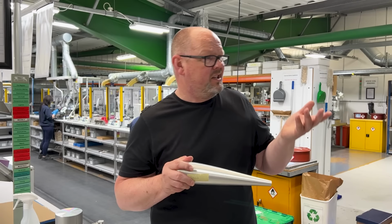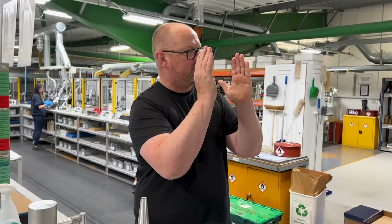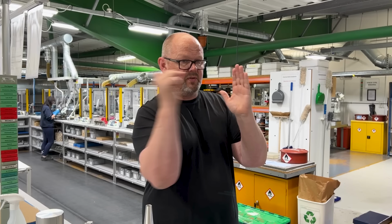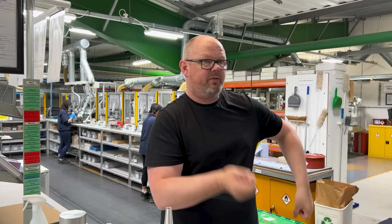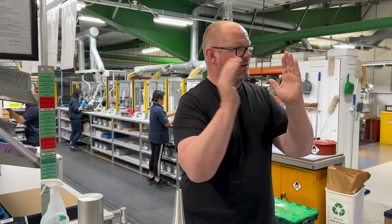So the idea is, if the diaphragm's doing that, it's generating pressure inside the enclosure. The more it moves, the more pressure builds up inside the enclosure, to a point where that pressure is actually exerting a back pressure against the dome. Rather like if you're trying to pump up a football with a hand pump and you get to a point where you can't get any more air into it, it starts to push back against you. So it's the same thing. The idea behind tube loading is you move the back of the diaphragm cabinet away from the back of the diaphragm, and then you allow the energy to dissipate down a damped tube.